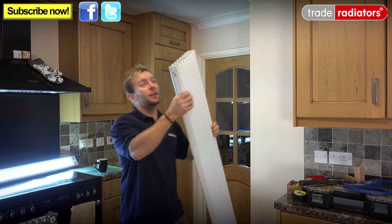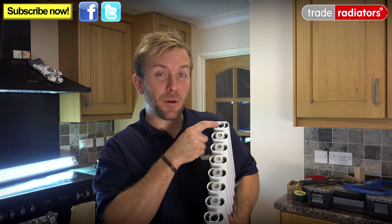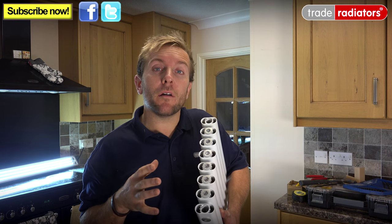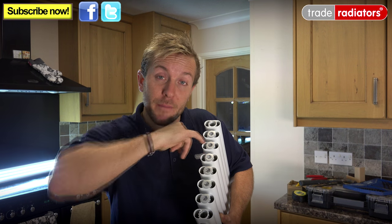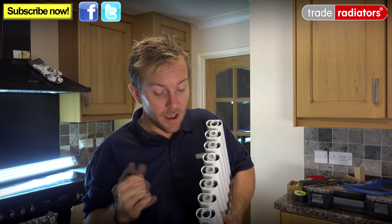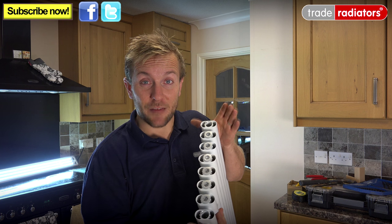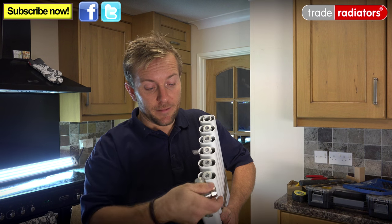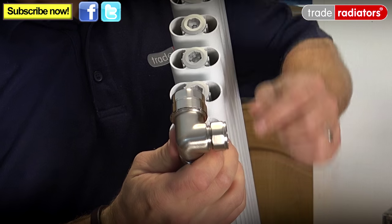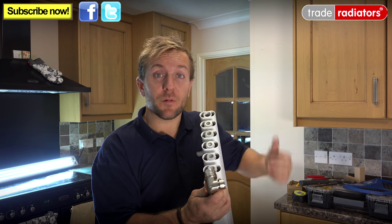A few things to note with this type of radiator — they're actually very versatile. We've got a blanking plug here and here, both taken out. If you have difficulty getting radiator valves on the end, you can use one of these bungs and also put a slight diverter in the pipe to make sure heat flows evenly around the radiator. We don't need to do that here because we've supplied some special radiator valves called round corner TRVs — the insert goes inside the rad and the pipe goes back through the wall, keeping the TRV head tucked underneath the radiator and not protruding out the side, which is important given our narrow wall.